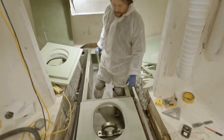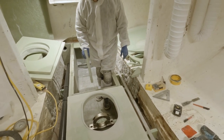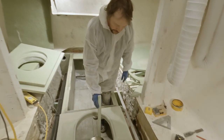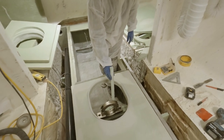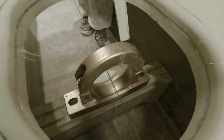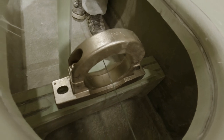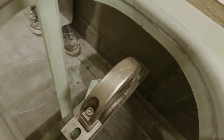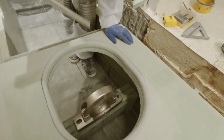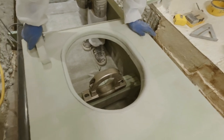Just a quick mock-up here. The centerline string represents the center of the shaft right there. Roughly positioning this, it's just on an inch and a quarter pad right here, just a foam pad. When we laid this out, we basically made it so we'd have a pad probably three-quarter inch thick on top of this for our bearing to bolt down, and then a little bit of space left for shims so we can get the correct height. Pretty critical.